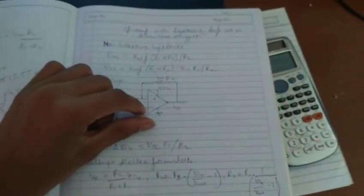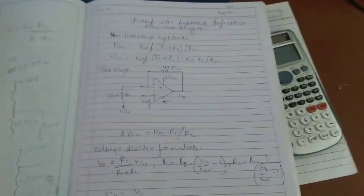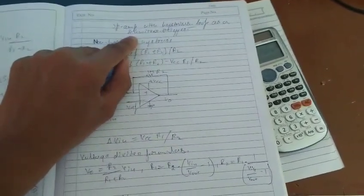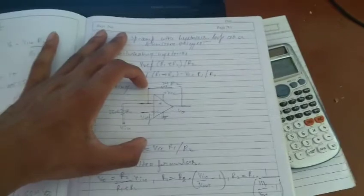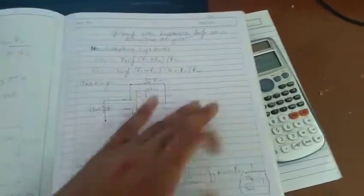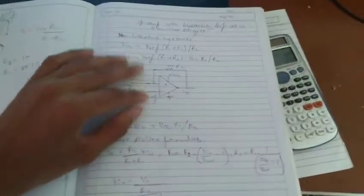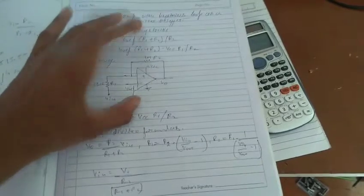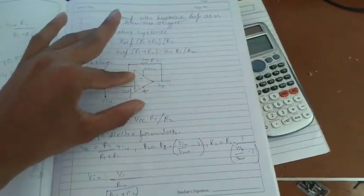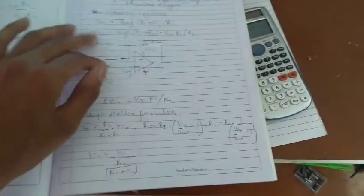Here is the circuit for the voltage monitoring — it is a really stable Schmitt trigger circuit. For the reference voltage I have a 100-to-1 attenuator, which is just a voltage divider circuit. That attenuated voltage is fed to one terminal of the op-amp. Basically it is an op-amp with very high positive feedback, and these are all the calculations for the resistances.